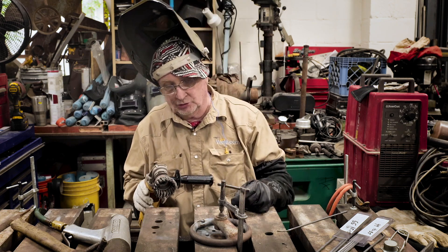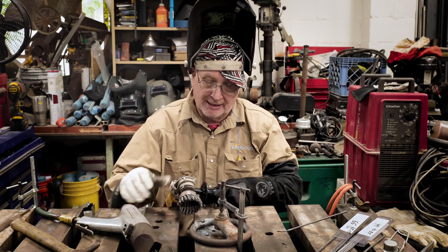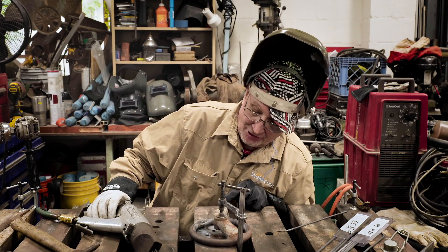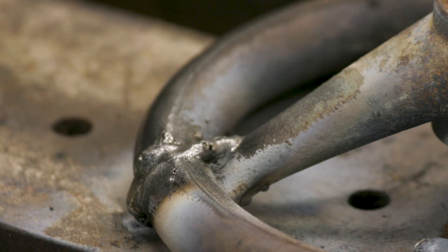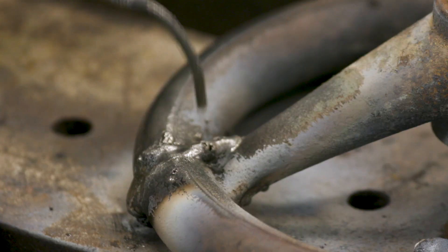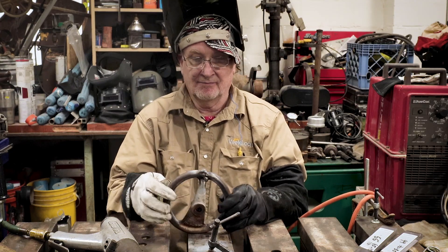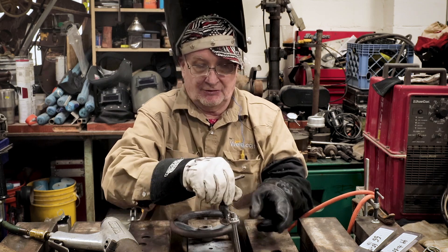Now I'm going to use the wire brush on this one since we let it cool slightly — I want to see the difference in how it looks, because when you're peening it with the needle scaler it really beats the devil out of it. I'm not hearing any clink-clanging and banging, which is a good sign. That could have been laid down a little smoother over here — that was at about 85 amps and I bumped it up to 90 amps on this edge. Here you can see the 99 side and the 55 side; we've got a little bit more welding to do on the 55.